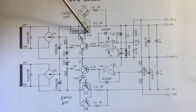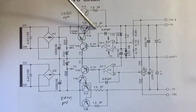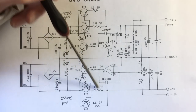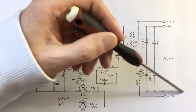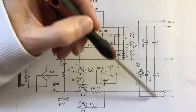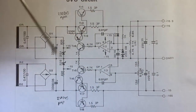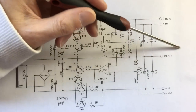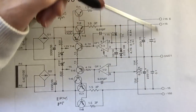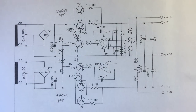This power supply mostly goes to the op amps, so it's really critical that the op amp receives a balanced supply on both sides, so the waveform it's outputting is centered around zero. If one side is too high, that waveform will be biased towards that side, giving a DC offset. All the modern supplies now use separate linear regulators for positive and negative, regulating in isolation, so outputs change not relative to each other - you get small DC offset issues. Whereas this supply synchronizes both, keeping that supply perfectly centered so all the op amps can emit waveforms with no DC offset.